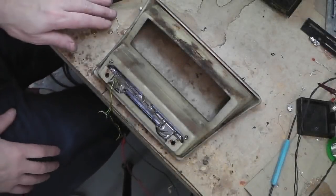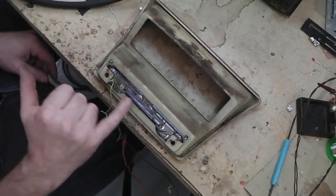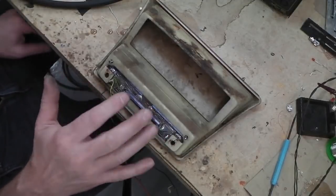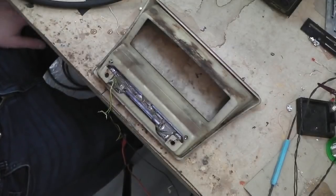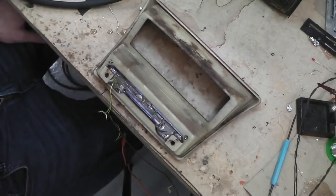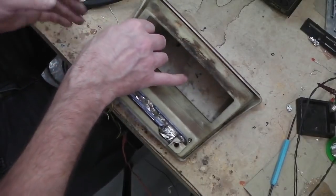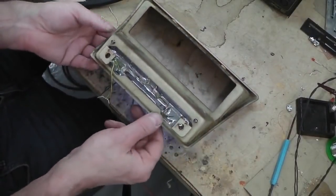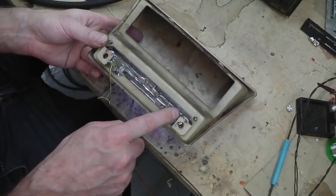Okay, join me on the bench then please everybody. 100 ohm resistor just by my little finger just keeps the current down. There's no need to drive these LEDs at full power. They just don't need it. The brightness required is nothing to light up that little escutcheon panel or that decal panel, whatever you want to call it. So there's the resin, quick setting in about 15 minutes, like a gel type finish, but it's solid,